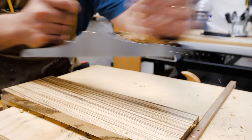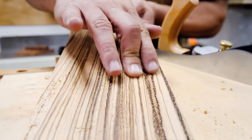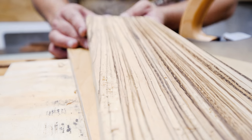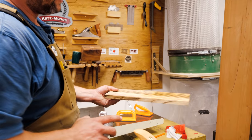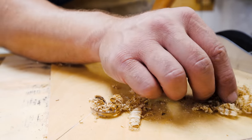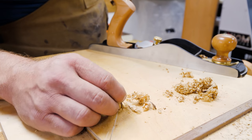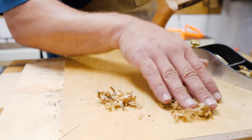It is just finish ready and smooth over here. You can see this is the side I was using the scraper blade on — just smooth, ready for finish. There's one little low spot, but on the other side, just tear out all over the place. That blade just kept grabbing. Here's the chips from the scraper blade and here's the chips from the regular 25-degree angle. These are almost like dust — really fine, wispy shavings, almost like what you get cutting end grain. And you can just tell the others show tear out and different thicknesses because the grain kept wanting to come up and grab. You can really see why a scraper blade makes such a difference in a low angle plane.